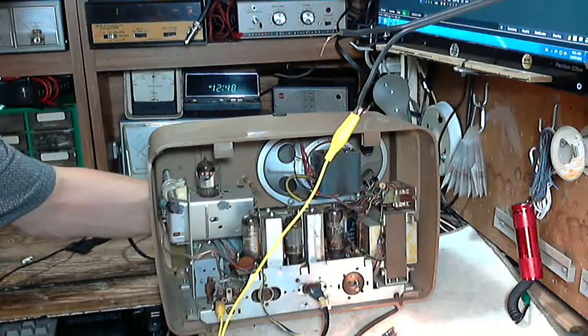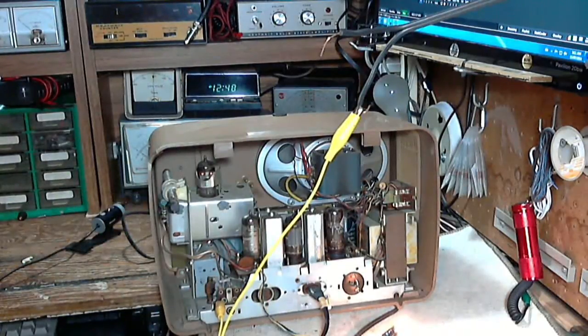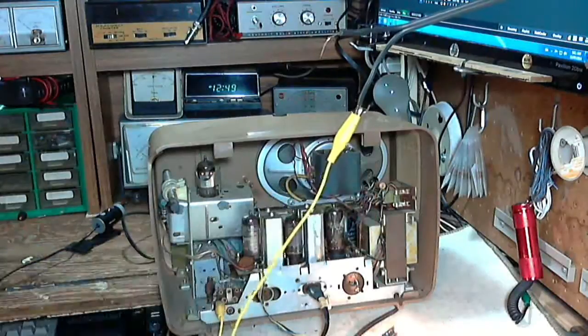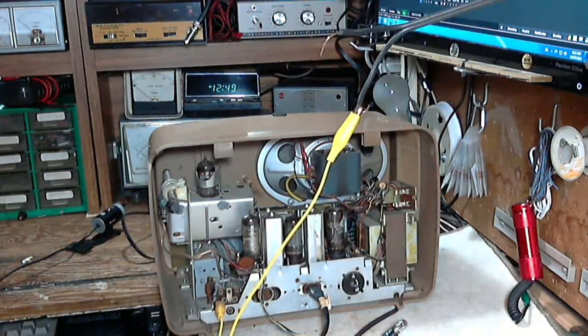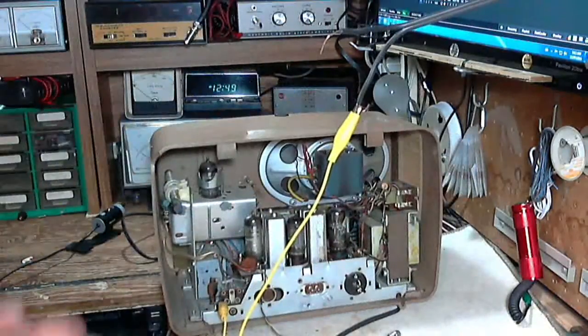Let's turn it down and do a little experiment. Okay, so that's fully turned down and you can still hear it. It's a common thing I run into a lot with these radios — I don't have a handle on why this is. Quite regularly I turn these guys down and you still hear them. I mean European-style radios, but I've had this on North American radios too. Obviously the signal is getting from the radio into the amplifier. Let's get rid of that hum — that terrible hum. It's going to be coming from the power supply capacitors being weak. And I also see a capacitor up here that doesn't look too good. So let's shut her off. You can really tell there was a hum when you get rid of it. The hum got very distinct when I put it on full voltage.